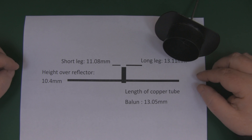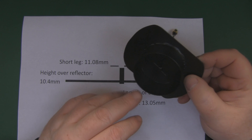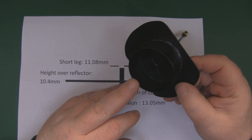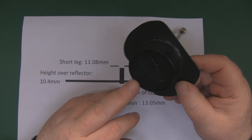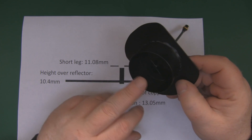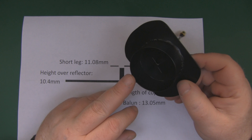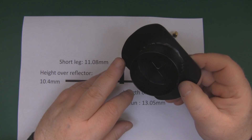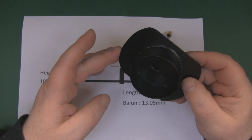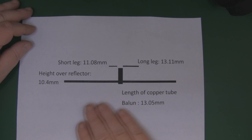In this video I'm going to build a crosshair antenna for the 5.8 gigahertz frequency, normally used for FPV. I'm going to add my own twist and enclose it in a waveguide to get a little more range, though it does narrow the beam width slightly. You can use these methods but just replace the waveguide with cardboard or plastic tubing to protect the elements. The back reflector should be about 80mm in width and 180mm in length.